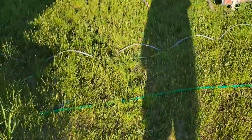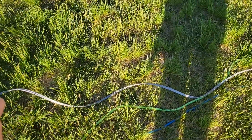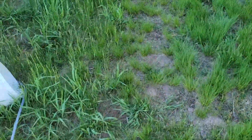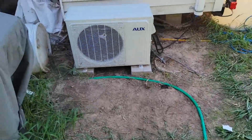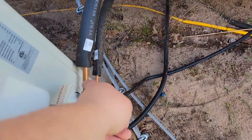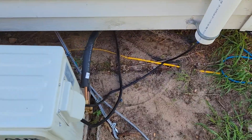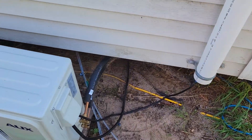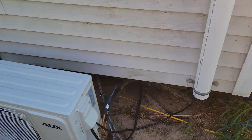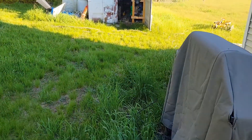I've got a temporary setup right now — this is a 10-2 wire that is underground-rated, so it's not UV shielded, but I'm just testing it to make sure it works. Everything is sealed up now; you can see the fan is running. It's definitely putting out hot air on the outdoor side, and the refrigerant line is ice cold to the touch, which is excellent. Now we just need to run some tests to confirm everything is working as it should.